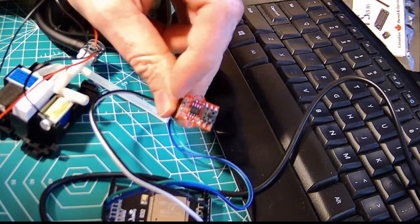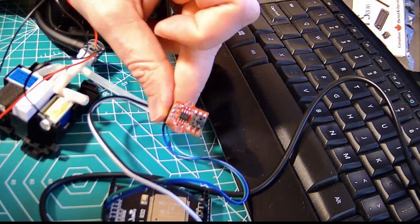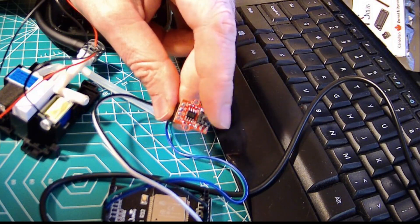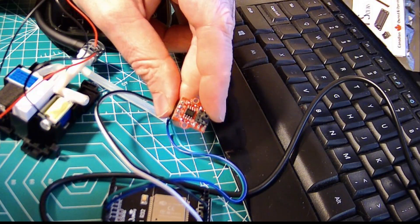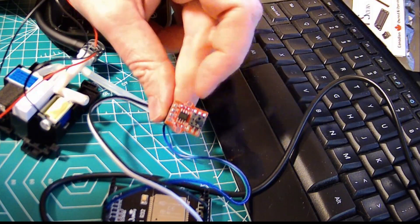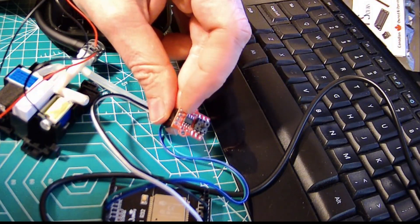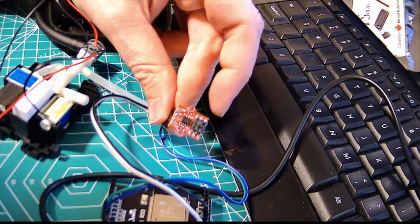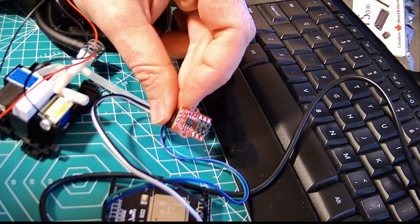This is paired with another little IC here, which is an analog-to-digital converter. It has a proprietary serial interface, pretty simple. The pressure sensor itself outputs some tens of millivolts and needs to be amplified. This A-to-D device has 128x gain and converts that into a serial digital signal — 25 pulses fed in and 24 bits of data out.